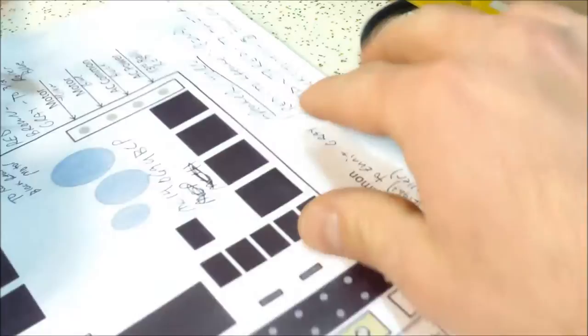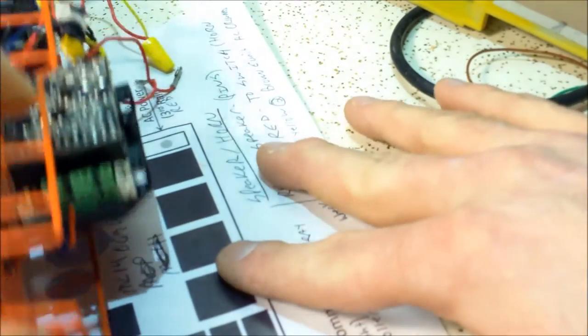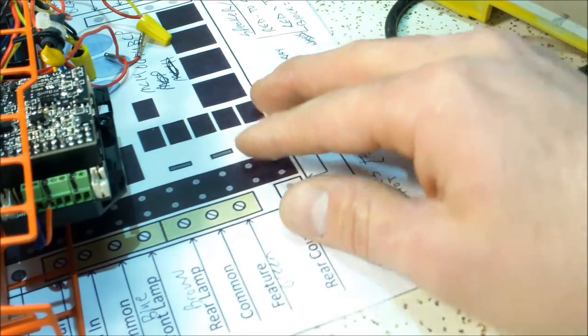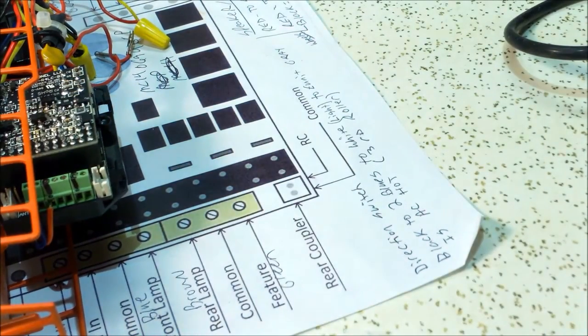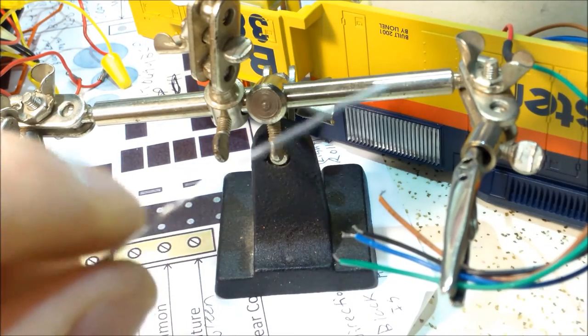I got the light bulbs back in place with the wires tied and marked on my paper. I'm going to lay the train this way so I can line them up with the marks and figure out what they actually are. I'll take a very small amount off of these wires so they're all about the same length, then strip and tin them. I'm going to put a little solder on each one of these wires to keep them together.